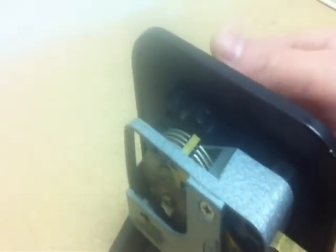So as you're rotating this, you line up your first gate with the fence. Rotate it back — the wheels are interconnected. Line up your second one with the fence. These all coordinate to the numbers on the front, so this number here is about 50 — it should be right on 50. Rotate your last one. So this is basically what's happening as you're dialing in the combination and the gates are lining up with the fence.